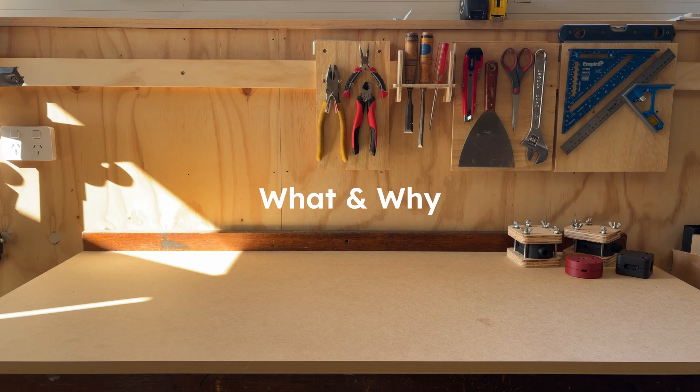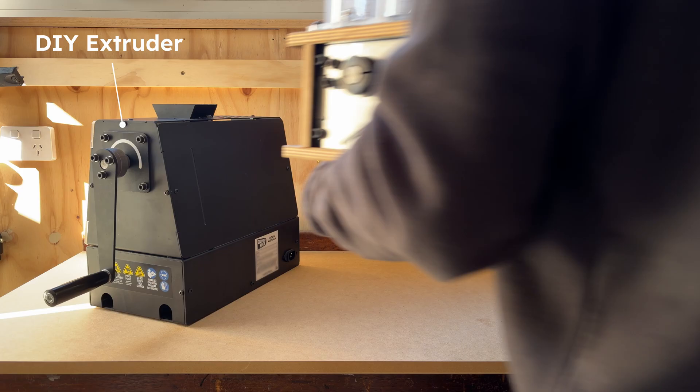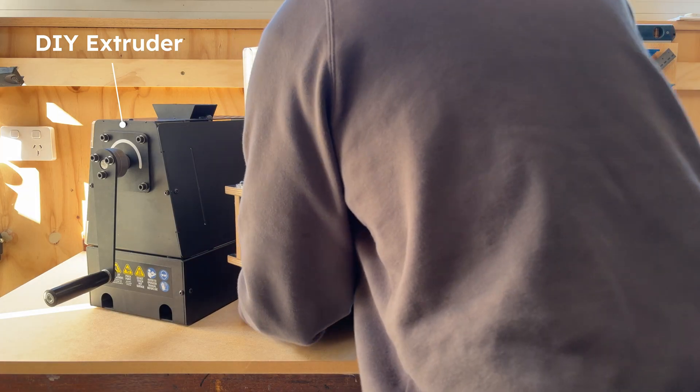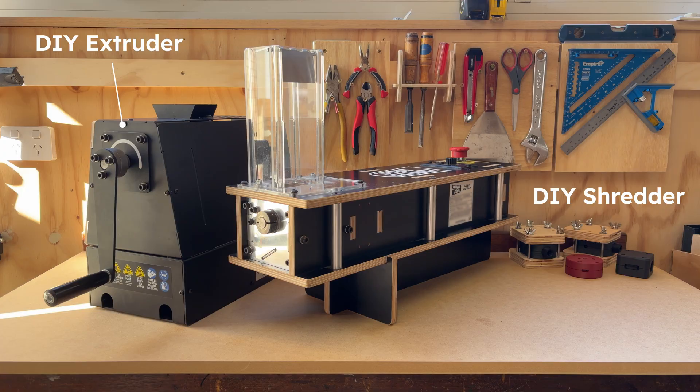There's a community of DIY plastic recyclers using simple DIY injection moulding equipment that you can either make or buy. This is a great way to both raise awareness of plastic waste but also to actually make use of plastic that would otherwise end up in landfill. The moulds for DIY injection moulding machines are usually made of aluminium, as it is relatively cheap to machine compared to professional tool making materials, and it can be made into accurate, durable moulds. Aluminium is a great option if you plan to sell lots of parts, but if you're experimenting and iterating like me, aluminium moulds aren't ideal.